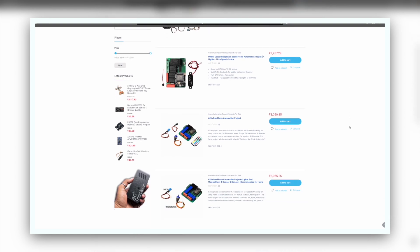When I saw it for the very first time I was really fascinated, and I wanted to make one for myself since we also need to program a lot of projects that we sell online. The major problem we face while programming different projects is that a single project requires a particular board package version and a particular library version. If you update any board package or library, the same code may not compile or give expected results. So it's better to have a firmware file of each code and a tool like the ESP Offline Flasher to make uploading faster and error-free.